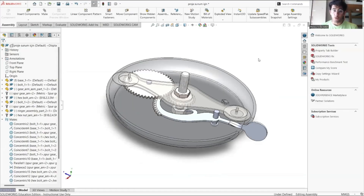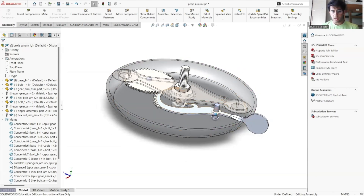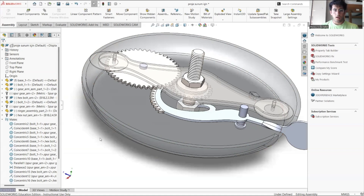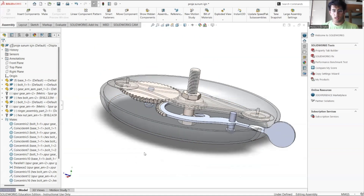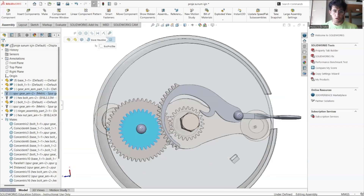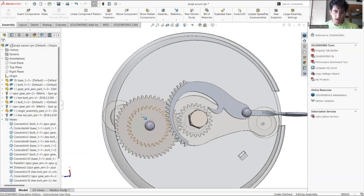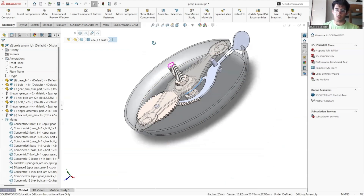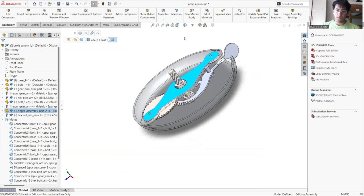Hello everyone, my name is Jussain, and I will demonstrate how the motion occurs inside the bicycle bell and the force applied between parts. I wanted to use another drawing from Emre's so that I can show you the motion more clearly. Emre already introduced the parts, so let's continue with the assembly. Our spike is attached to the bolts with concentric mates. As you can see, our spike has teeth on its hook side. These teeth are gear-mated with our first cogwheel. This is our first cogwheel, and it's gear-mated with the teeth on the spike. Our first and second — the bigger cogwheel — are concentric mates. Our second and third cogwheel are gear-mated. Our third cogwheel is also concentric-mated with the arm carrying the washers. This is basically how the parts are assembled.